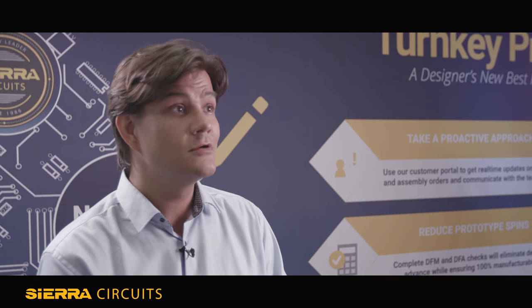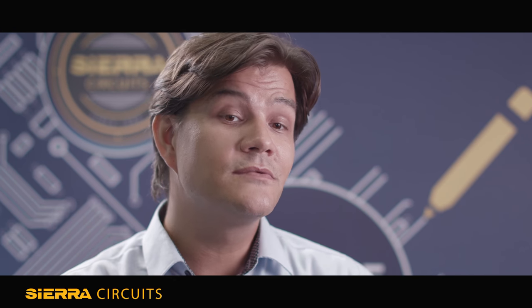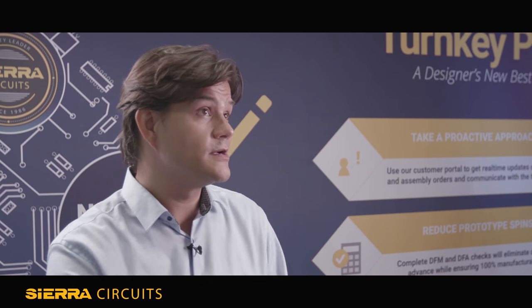The dielectric inks currently available with the Dragonfly system are engineered to be electrically as similar as possible to traditional FR4 or phenolic-type dielectrics, meaning they're not optimized for the very high frequencies that you might otherwise turn to PTFE-type materials for. That being said, the real focus of the system is rapid prototyping. We do test our materials up to around 20-30 GHz and they maintain a very stable dielectric performance all the way through to those high bounds.